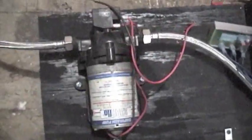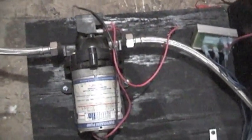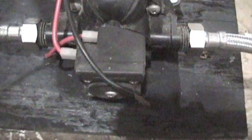That's the water reservoir, and that goes to a diaphragm pump, so that'll feed the boiler. The way it works is it will shut off when it reaches about 50 psi — it's got a little pressure sensor. So if the boiler's not needing water, it'll automatically shut off.